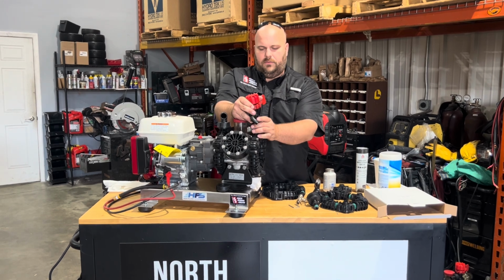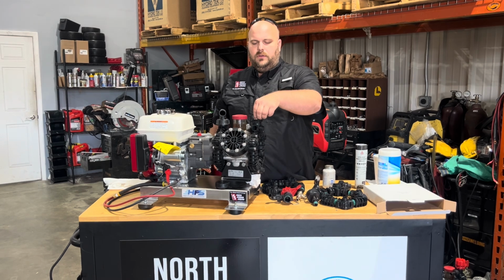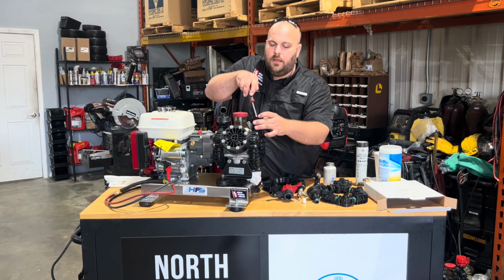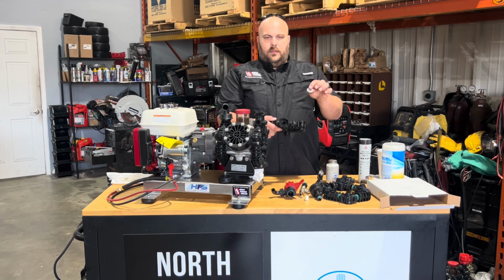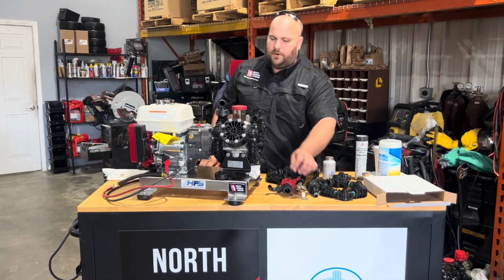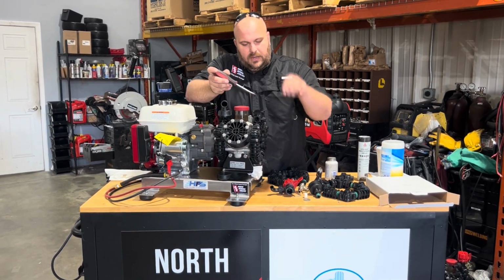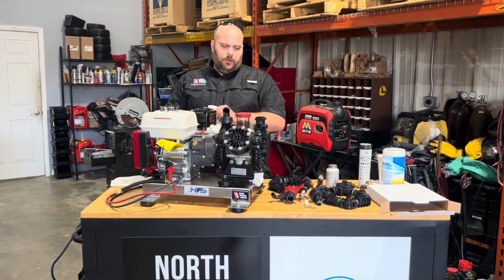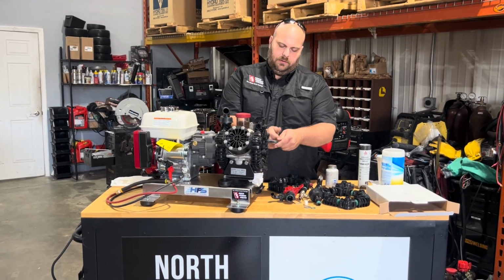The control valve. The two most important parts of this: after you remove the valve, you do have a ceramic plunger, and there's a washer inside here as well as an O-ring. The new assembly does not come with that O-ring. That is a separate part. And the most common phone call we get after these things have been changed are that O-ring and that washer. So, once we have that out, we're ready to actually remove the manifold.